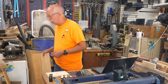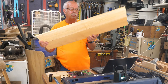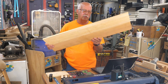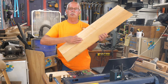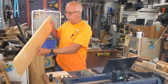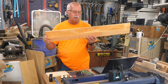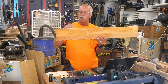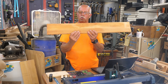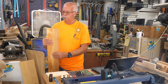For the back of the upper part of the sign, I have two cut-off pieces of fence picket. I haven't run them through my planer yet because this is nominal thickness, meaning they're not all the same thickness or width. But I did run the edges on the joiner and edge-glued them together, so that will be the upper part of the sign after it goes through the planer. The lower part will attach to the upper part with a couple of little eyes and hooks so it will kind of swing at the bottom in the wind — this is where the 'Stress Free Zone' lettering will be.